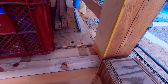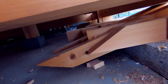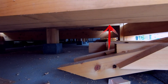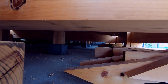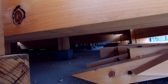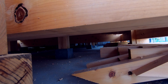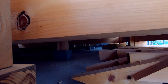On top of the floor structure — actually what you can see under here — there are these intermediate members, kind of like large joists. Those are called obiki. And those are supported by these little posts that you can see right there called tsuka. And those are actually not even tenoned into the obiki — there are just two nails holding them in place because they really just support the downward force.